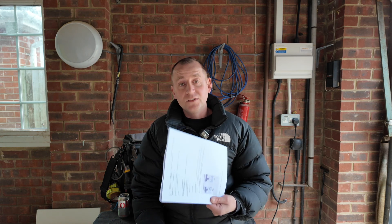MyEnergi have come back and said: 'Thank you for the images - these have been reviewed by our engineers and we can see your Zappi does not have any RCD protection. Unfortunately your installer has fitted an MCB which only protects the circuit. They should have fitted the same circuit breakers as the lighting RCD next to your charging circuit - this is the correct Type A RCD. As of March 2022 when the wiring regulations were updated, all EV chargers including the Zappi must be fitted with upstream RCD protection.' This is in writing from MyEnergi.